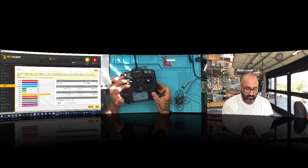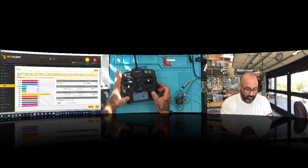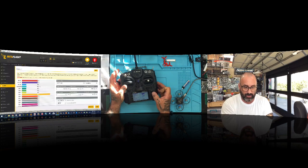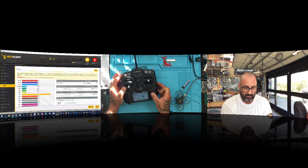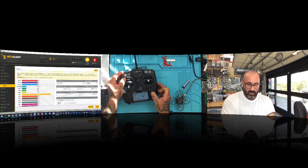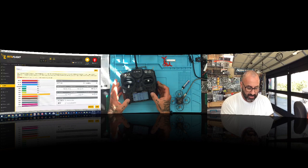Exit and go to channel four, which is yaw. Edit, go to minimum, click and scroll up until it reaches 1000. Go to maximum and scroll down until it reaches 2000. We're pretty much set. The channels by default on the radio are set up incorrectly, so now we need to set up these additional channels.